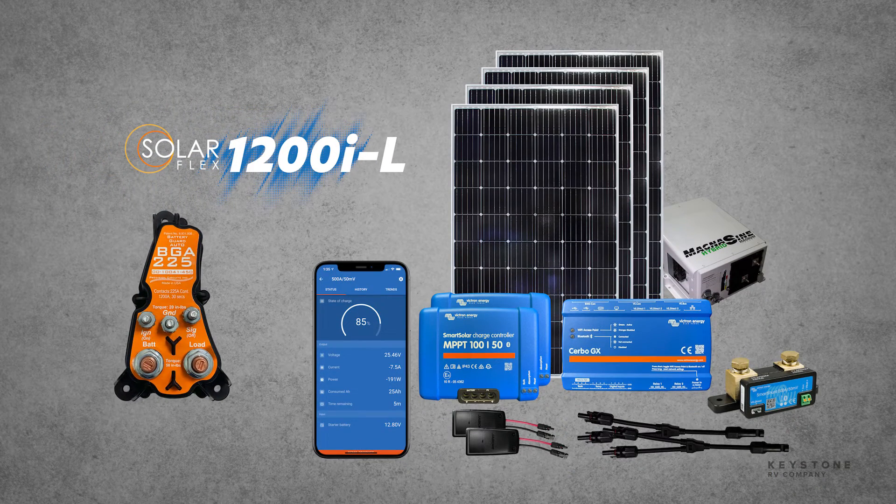There's also a Precision Circuits energy management system. What that does is if something kicks on, or you forget you're running an air conditioner, or you're running a microwave and somebody starts a fireplace or plugs in something large and you go over the amp limit of the inverter, it's going to turn off load. It'll start shutting stuff off to make sure you're not kicking out the batteries or overloading the inverter. There's also a battery guardian from Precision Circuits, which is an automatic disconnect. When you hit your switch and disconnect the coach, it will automatically shut off and not let you continue to run your batteries down when it gets to 11.6 volts.